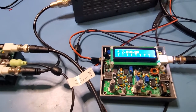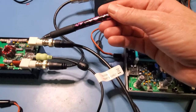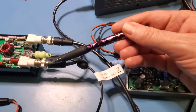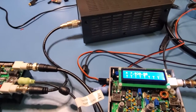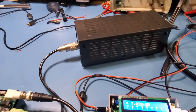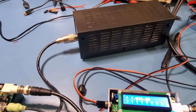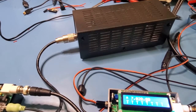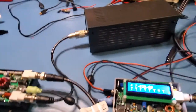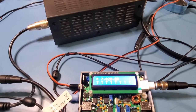The RF output from the QCX goes to the RF input of the amplifier. And then we have the RF output of the amplifier going into a 1,000-watt dummy load. One critical thing to be careful with when troubleshooting: make sure all terminations are 50 ohms. Don't leave the RF output of the amplifier or the QCX open — you will quickly damage your equipment.